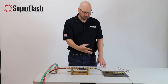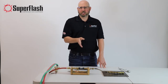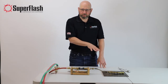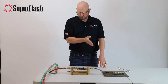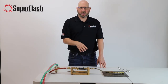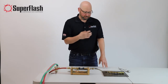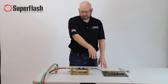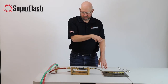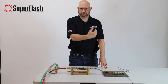That's why we always say you have to know the difference between a check valve and a flashback arrester. All flashback arresters have the check valve built in. So if you put a flashback arrester on the line, you take any check valves off because they won't provide any more protection — they'll just cause more restriction. The flashback arrester adds a flame barrier, which acts like a heat sink. It protects the check valve by surrounding it, keeping that flame from hitting the check valve. In the previous demonstration, when the flash hit the check valve, the flame went right past it. When you add the flame barrier around the check valve, it keeps that flame from hitting it. So when it just becomes gases, the check valve can do its job — you get that negative pressure, it shuts, and it's fast enough to do that.